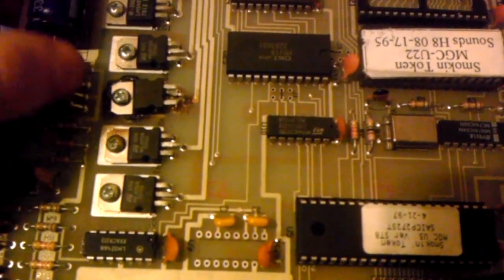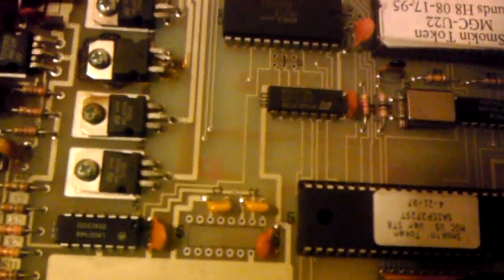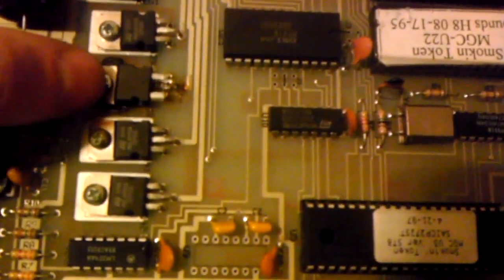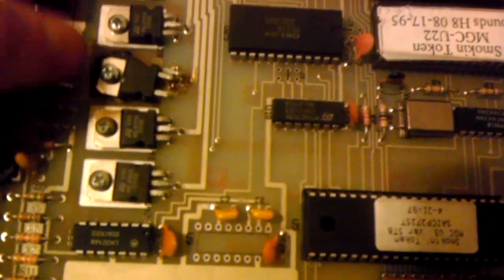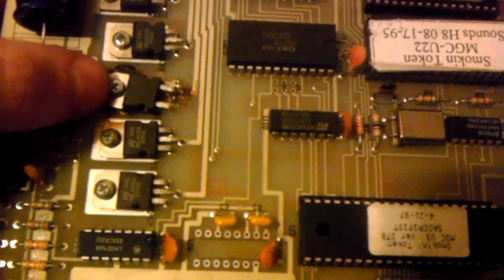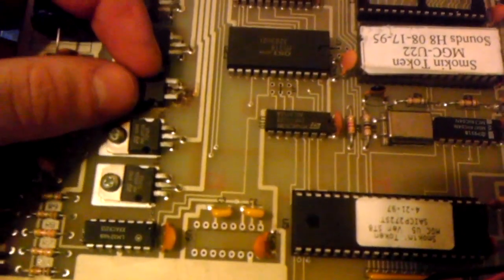Now, this piece, for some reason, doesn't have a metal backing like the other ones do to dissipate heat. So when I get it back in the machine, I'm also going to do a temperature test on it and make sure that we don't need to modify the design to include a heat sink. With a field effect transistor, it's also important that you don't short heat sinks to ground, or really to any other component, unless the manufacturer specifically tells you to.